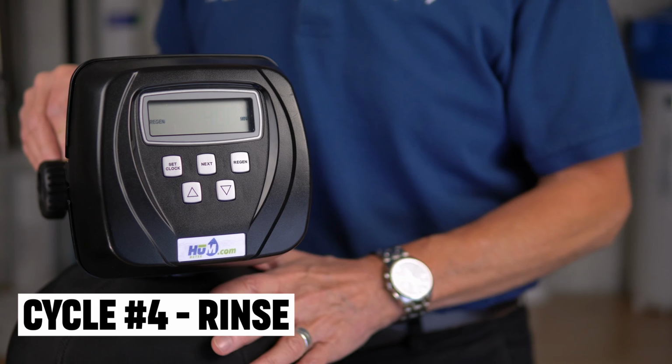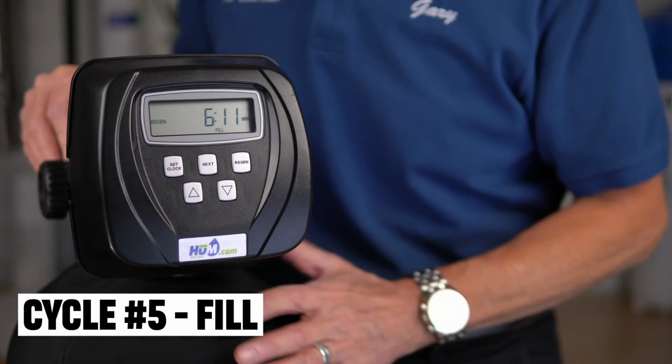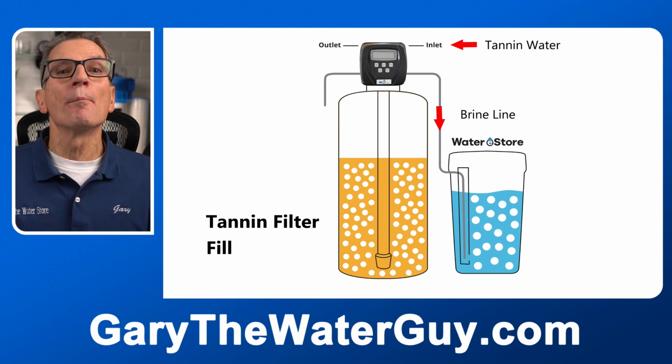The valve now shifts the flow back down through the media beads and back up through the riser tube to settle the media beads back into place. The valve puts the right amount of water into the brine tank to make the correct concentration of brine for the next regeneration, and then puts your tannin filter back into service.